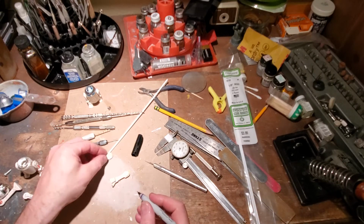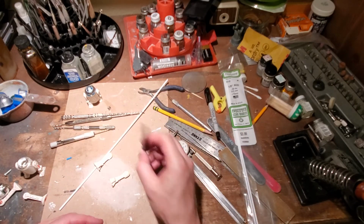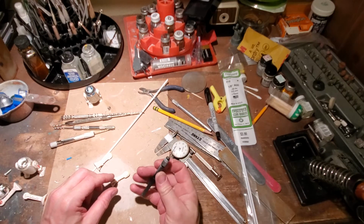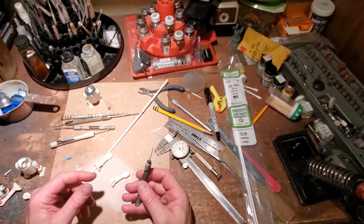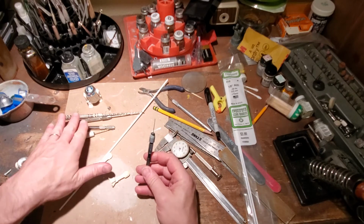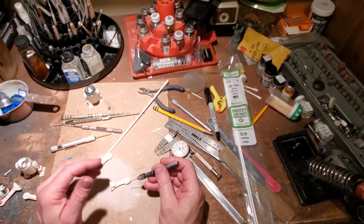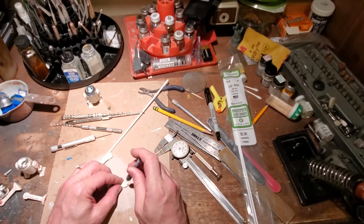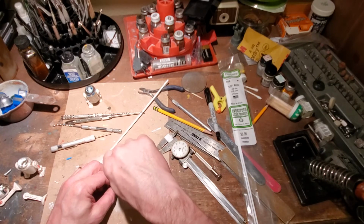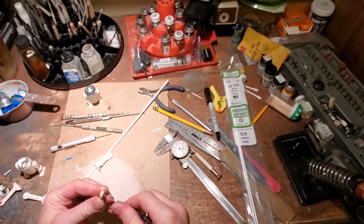And now what I'm going to do is I'm going to take a pin vise and drill in the holes. I'm going to start small. I can't even tell you the size of bits. I just have multiple bits and multiple pin vices, as you can see here. Do not use a Dremel. You will wallow out the hole, and this in any plastic. Unless it's really thick, don't do that. That will surely destroy it.